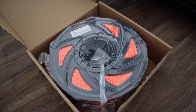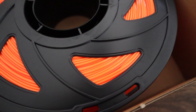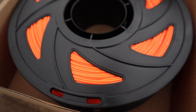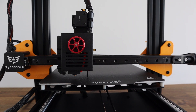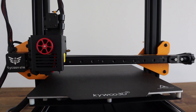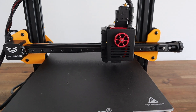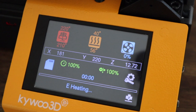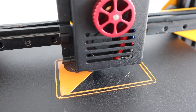I exported the case shell halves and opened them up in Cura for slicing. I hadn't used TPU before so I still had to experiment with the print settings, but I found some general guidelines online and used these along with Kiwi 3D's suggestions as a starting point. Printing in TPU did have its challenges and I had to play around with the settings to get a reasonably good quality print. Because TPU filament is flexible, it's really easy to run the extruder too fast — the filament folds over itself and blocks the top of the hot end. I had two initial prints fail quite early on because I was printing too quickly and at too low a temperature.